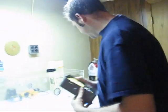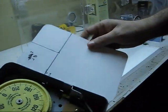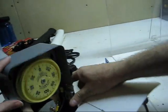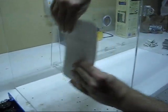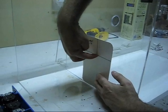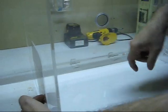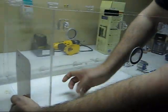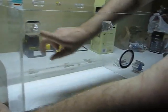Basically you have a rod. This is a template - this hole is the center. This is what your rod is going to connect to, right in the center. You basically have a rod that connects to this, goes through the tank, right where you're going to drill your hole. The rod goes through the tank onto the egg sack chamber and spins it. Underneath it are pulleys with rollers so the egg sack chamber can roll on them.